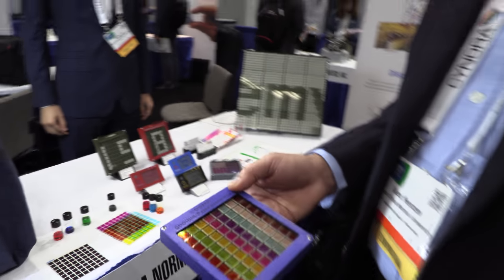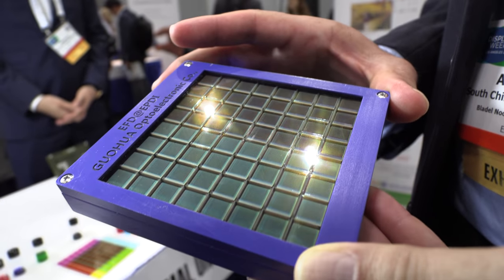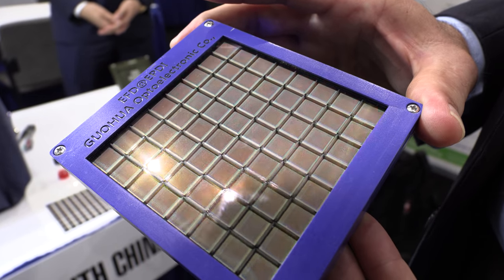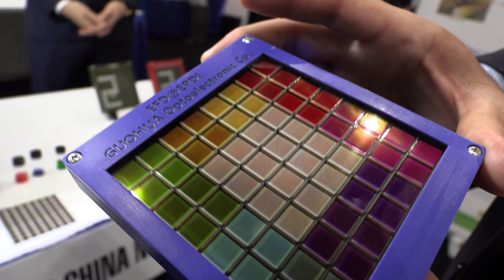The technology is similar to Liquavista, but uses a different approach. Liquavista used RGB color filters, which caused a lack of reflectance and too dark a white state. Instead, Alex's team went directly for the three-layer system and did the math necessary to make it really bright. Once you get a bright white state, you get the colorfulness for free.